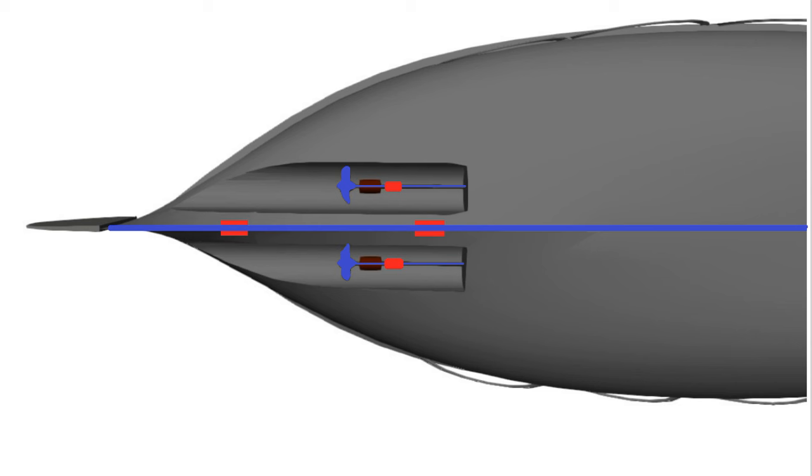Commonly made of aluminium or zinc, when attached directly to metal fittings, such as the keel and propeller shafts, these sacrificial lumps of metal will react more readily than the components they are attached to. This means that instead of the important metals on a boat dissolving to nothing, it's the anodes that will waste away instead. Once an anode is exhausted, the metal component it was designed to protect will in turn begin to corrode. If anodes are not maintained, serious damage will occur. Yet, after more than 90 years, it's a testament to Dowager's previous owners that the vast majority of her underwater fittings are in really good condition.